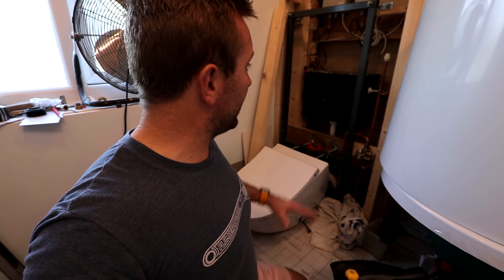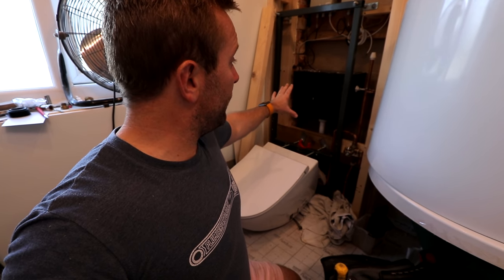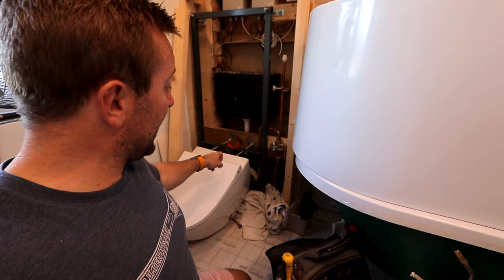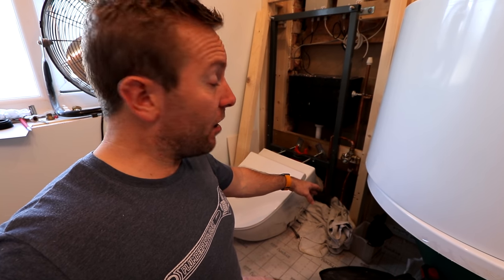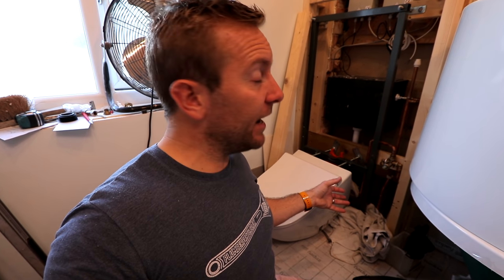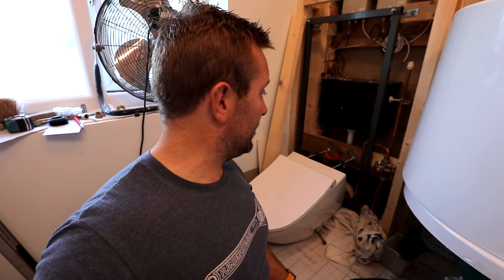So if you haven't subscribed to this channel and you wanna see what's gonna happen here, subscribe - hit the bell and the notification, and then you'll get notifications when I upload a video. What I'm gonna do now is just get the bit for the water system popped in a bit higher up. Then we're gonna get that pipe round and stick it out in the right place for the toilet bit down here. Also then I'll put in our little inch and a half Durgo which will go in there. I'm also gonna put the Durgo under the bath as well. I like Durgos - they're a good idea. They allow things to drain really quickly, and they help everything vent nicely.